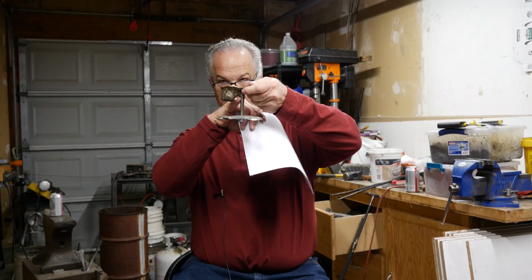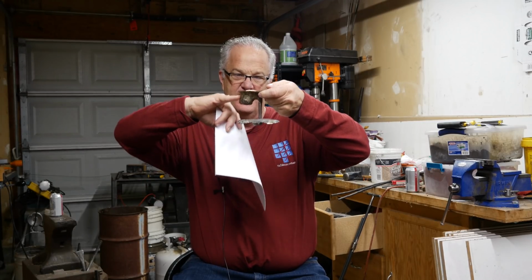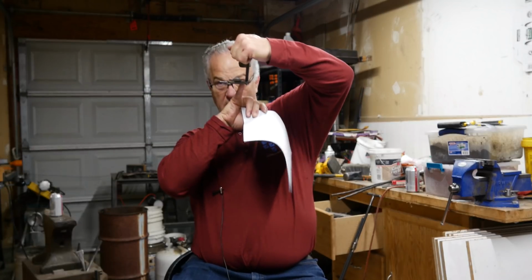Fast backfill of properly designed sprue. I think that my ridge gives me a fast fill of that thing because the metal stays up above the ridge, so it's constantly keeping the sprue full. Preferred use of stopper. I don't know what a stopper is. Avoidance of the use of wells and all other volume increasing features of filling systems. There's no well down there.